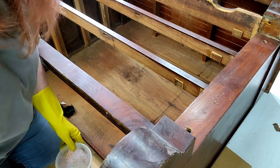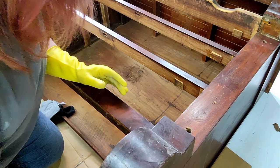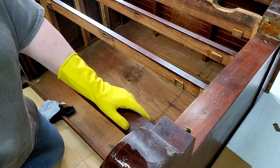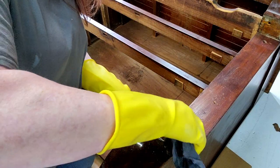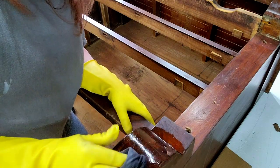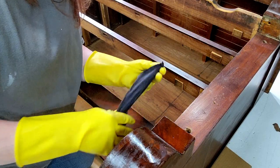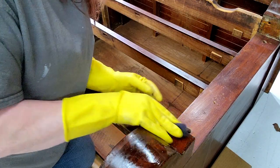We can go ahead and start cleaning it up with some denatured alcohol. What that's going to do is remove a lot of the old varnish but leave the stain, and then we can go from there and see. It's hard to tell dirt from old varnish, so we're just going to give it a cleanup and see what's going on. We can always put new shellac on it if that's all it needs, but I have a feeling it's going to need a lot more than that. This will take off the old shellac but leave the color and help reveal what's underneath.